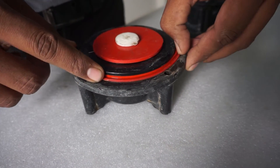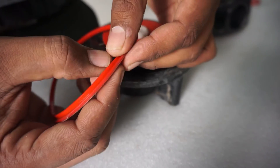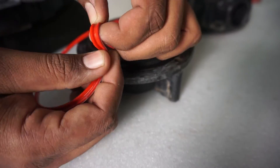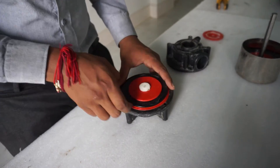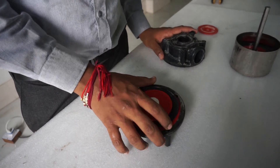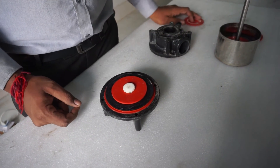Then check on the step rings — maybe they have gotten cut or simply moved out of their slot. By now you should have found the issue somewhere. If you didn't, please create a support case via www.support.futurepump.com and we will help to repair your pump.